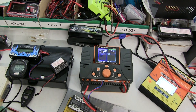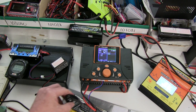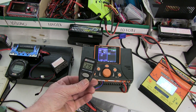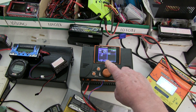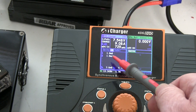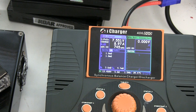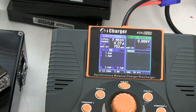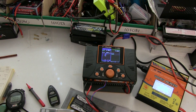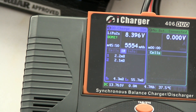I put the Orca battery back on charge at 10 amp rate after discharging. It's actually still warm — 27.5 degrees — and the internal resistance has gone down slightly, now showing 1.8 milliohms. When it was at ambient temperature it was 2.0 milliohms, so there's a slight decrease in internal resistance when warm. As the battery cooled down, the internal resistance went up slightly, and it's now gone back to 2.2 or 2.1 milliohms.